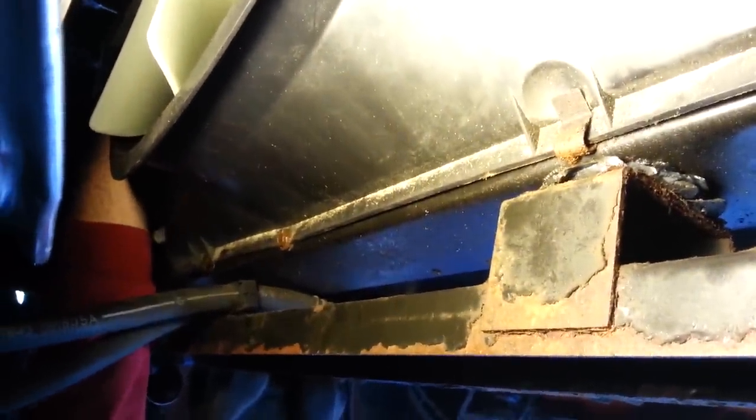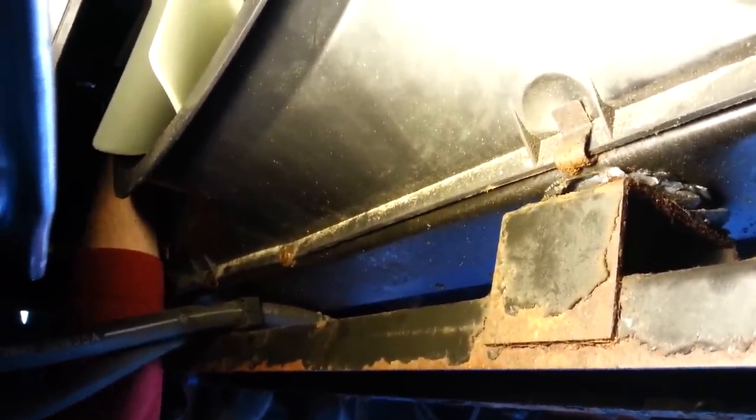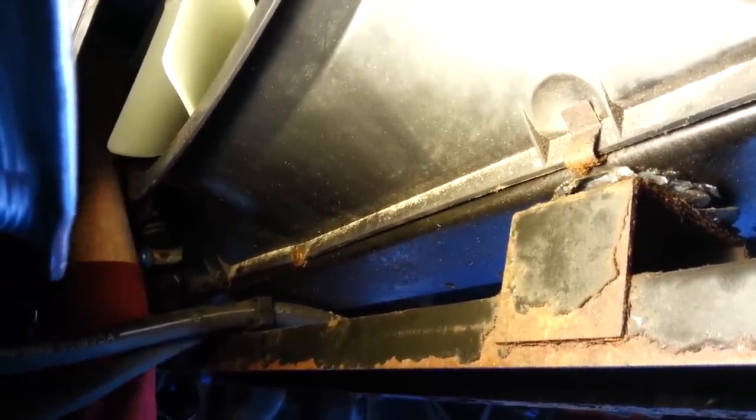We've got this all buttoned up and I noticed something important — the cowling. Make sure you get this cowling nice and tight all around the radiator. I noticed something on this side: this radiator was recently replaced, and I believe when they did that they left out the rubber strip between the cowling and the radiator. There's a large gap going all the way up and down, so instead of air being pulled through the radiator, the hot air is going to be bypassing through this gap. We're going to order that from Workhorse and get it put in — it just slips in place. There is one on the other side, so I suspect when the radiator got changed last year, they just didn't stick it back in. Make sure your cowling is in good shape and tight so air pulls through the radiator and not around the edges.